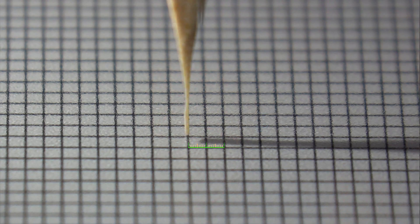The test consists of me taking zoomed-in photos of where the needle point sits and where the shadow is in relation to it. I use the one millimeter by one millimeter grid to measure out what that gap or shadow distance — the height — actually is. The bigger the distance between the line where the tip is touching and the tip of the shadow, the thicker the obstruction. This is how the original images look when zoomed in and cropped, with the grid showing fractions of a millimeter — so I can measure 0.1 or 0.15 millimeters. When doing readouts, I invert the image and adjust levels in Photoshop for better clarity over the shadow and the tip.